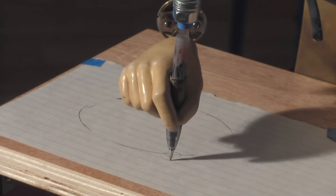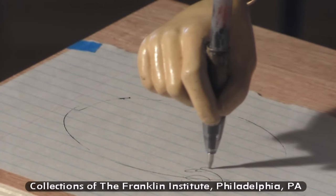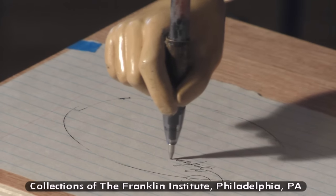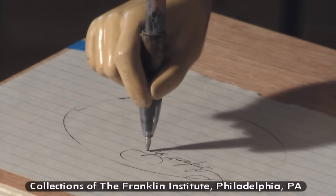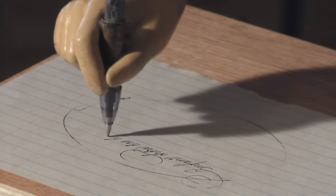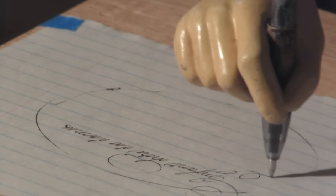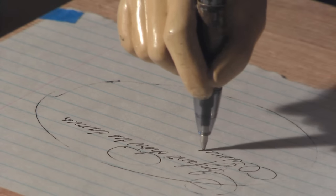So here we got it all set up, got the pen. Now there is no variation in the ink flow because of using just a regular gel pen, but we wanted to show the variations in the z-axis cams, which you see right here. As soon as it started writing, you can see that the pen tip is varying in its height as it's drawing a line, so you can see that the barrel of the pen is being pushed towards the paper during down strokes. This is showing that pumping action, where if we're using a floating stylus with an ink reservoir, the valve would be opening as the pen is pushed towards the paper, and closing as the pen is lifted, creating variations in ink flow as the stylus is moving around the paper.